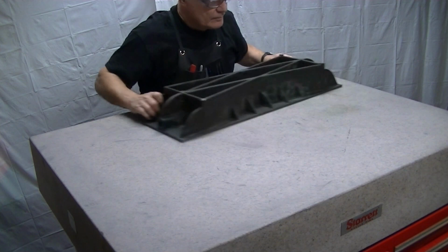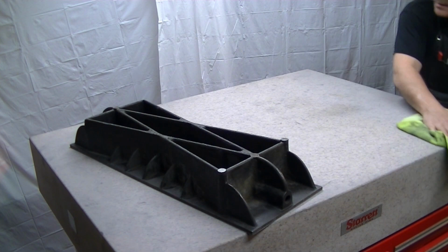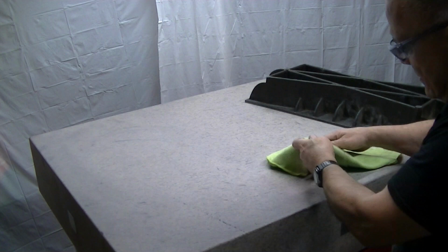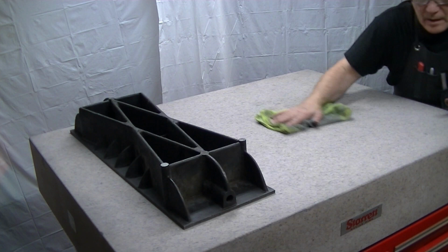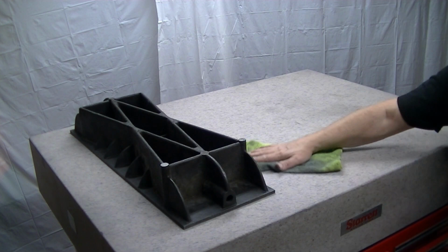So as with all lapping, this is being aware of all these factors that have an effect on how the lap wears, how the part wears. The cutting action of the abrasive, what kind of charge you have. Now the reason, from all that I've read and seen, wet lapping is not the greatest. If you're doing a lot of material removal, fine, but for final lapping, there is some moisture water absorption in granite. And if you're out for the nitty gritty, you need to be lapping dry.